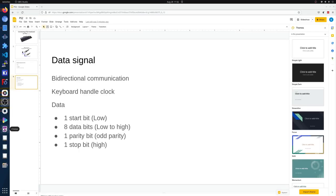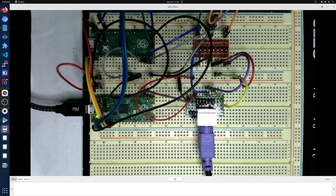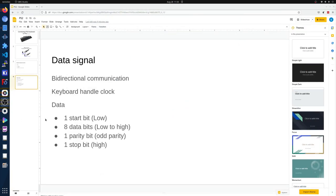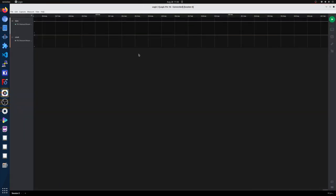On the board I have one Pico to program this Pico. I have a PS2 connector that's broken out — one line for power, one line for ground, and then two data lines going through level shifters going from five volts on this end to 3.3 volts for the Pico. All the other wires are for testing and grounds. If we open up the logic analyzer and run this, we'll see the lines are just high.